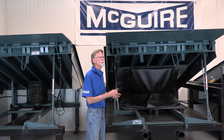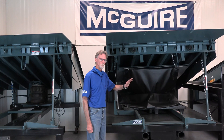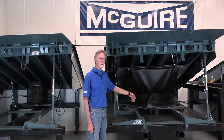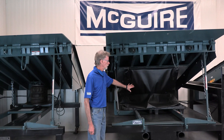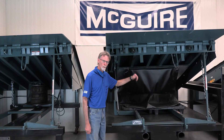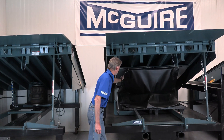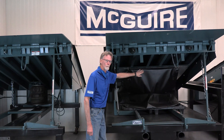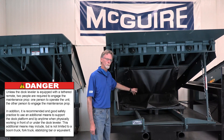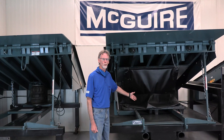The timing on this is probably around 30 seconds from dead in the keepers to full lift extension. So if you arrive at a job site and the customer tells you the leveler is taking an extraordinary amount of time to get up, I would venture to say you have a hole in the bag. If you can get it up on the maintenance prop, inspect your bag — the area you're going to look for is the seamed area for some kind of rip or tear, and also the back area. That's basically the biggest problem you're going to have with this type of leveler.